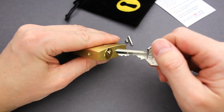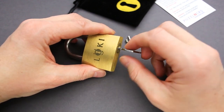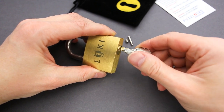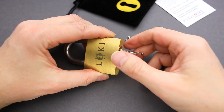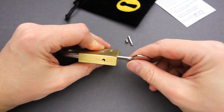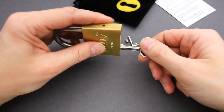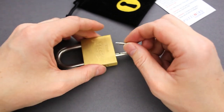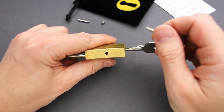I was able to move the key to 90 degrees and now I can even remove it — it moves so easily. I still have no idea how it happened. Maybe now I can open that cutout without the key and see what is happening inside. I can definitely see there is a metal pin. Maybe I can remove it. That is another tool! And this tool — the smaller part is much longer than in the Allen key. Now I will be able to open the lock.